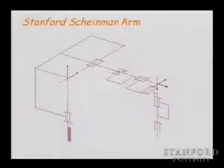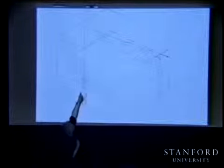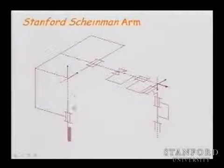So first, how can we do this? Well, we need a schematic. We need to see these joints and axes. So here is a schematic that we're going to use. It is sort of 3D. Always we are using the same concept: you have a rotation, and the output is going to the next joint, a rotation. So the first rotation of the arm is about this axis here, and then this is connected to the second one. I'm showing it this way. This here is in the plane containing this axis, and this is orthogonal to it. When we rotate about this axis, this whole structure rotates. And when we rotate about this axis, the following structure will rotate about this axis.